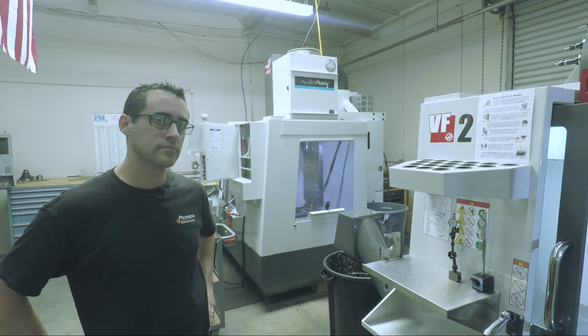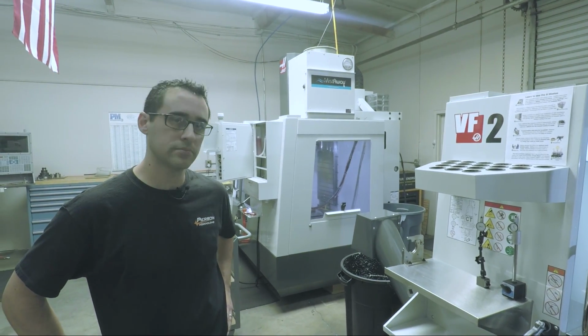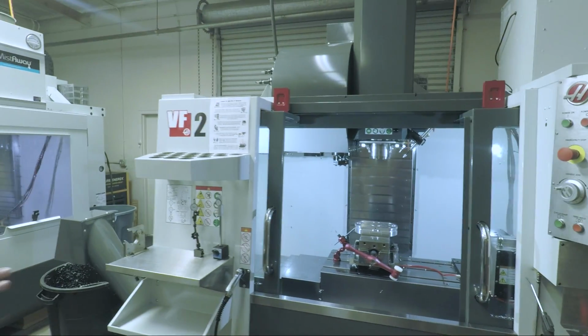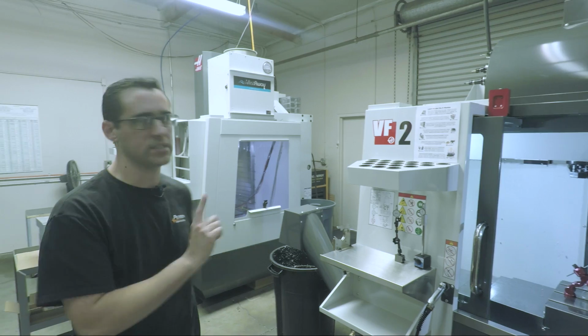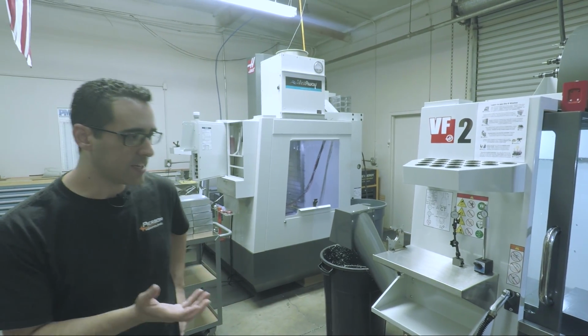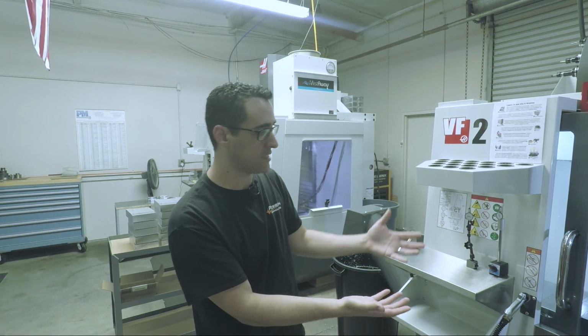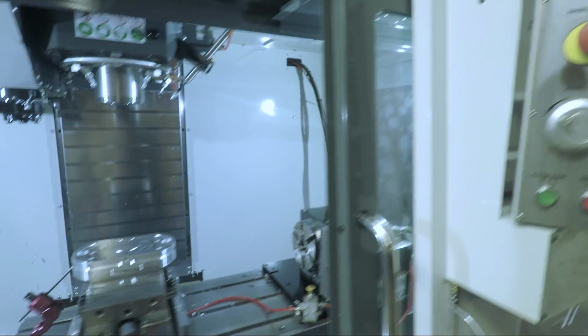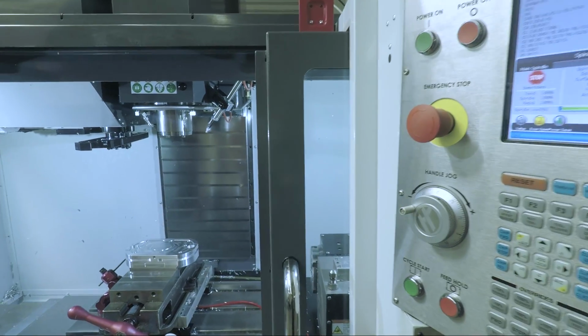Correct. And so that setup, and you're going to laugh, a lot of the work that we do, I could use a Wilton Camlock vise. Yeah, or drill vise, and that would easily mount. Yep, and you indicate it one time, and you give it its own offset one time. So, over years or months, however many setups you're doing, you're going to make that money back. Pretty straightforward.